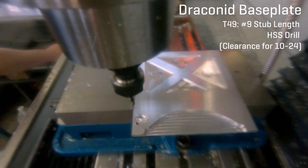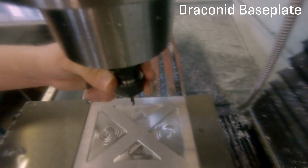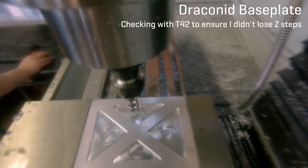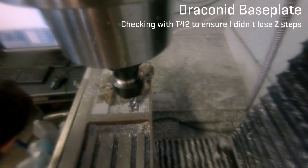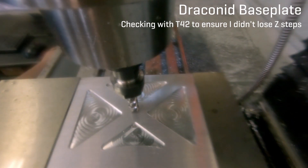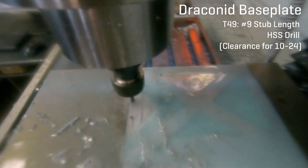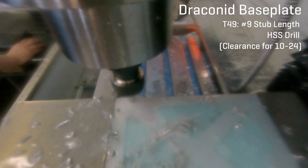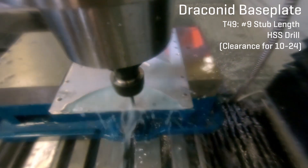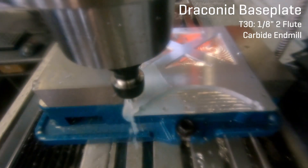Fortunately, all I ended up with was the hole being a bit ovaloid on the reverse side. The part was actually not bent and was otherwise pretty much perfectly usable. Here you can see I'm checking with my largest tool, the half-inch tool, basically just to make sure that its zero point is still touching the part. I also readjusted the drill because it got pushed up into the tool holder a little bit, so I basically just reset it to its original programmed length. The drill didn't break or bend, so it was actually not very long to recover from this.